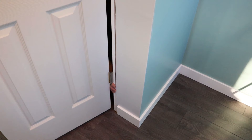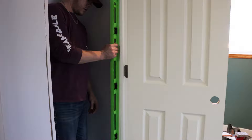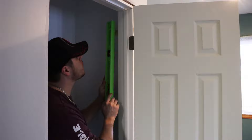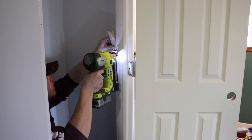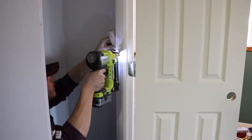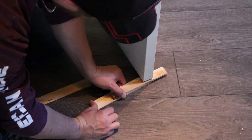The top is set into place. Now we can continue sliding our shims into the door frame, working our way down — sliding them just above the center and the bottom hinges. Once everything is good and the slack is taken up, but without exerting pressure, go ahead and check that the door frame is perfectly level and make any adjustments to your shims as needed. Also make sure it's still plumb with itself. If it has moved, kick the bottom in or out as needed. Once everything is good, go ahead and add your nails or screws through the door frame into the wood behind it.